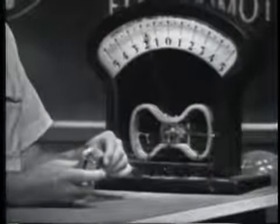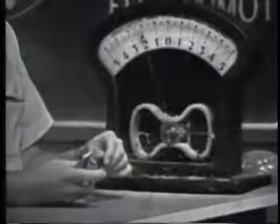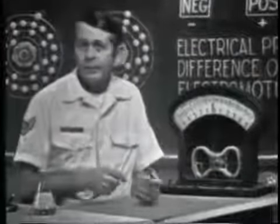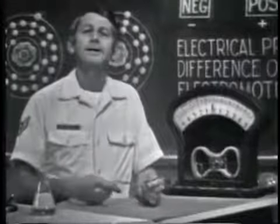A device that develops voltage in this manner is called a thermocouple. When two dissimilar metals are brought into physical contact and heat is applied to the junction, free electrons will move from the more dense to the less dense material. The result is a deficiency of electrons in one material and an excess in the other — one develops a positive charge, the other negative, so voltage exists across the two. The amount of voltage produced by this method is limited, but due to its sensitivity to temperature changes, it's often used for temperature measurement and in temperature control devices.